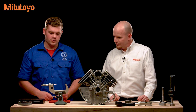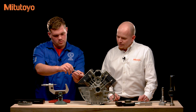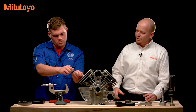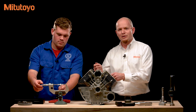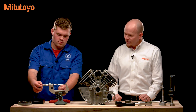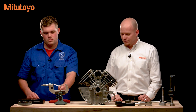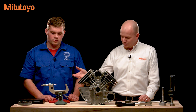We added eight ten-thousandths on this one — eight tenths higher. As you can see, there are a lot of potential sources of error with these. There's no live reading when putting it into the inside diameter, so you have to put it down, get a feeling for it, lock it down, and measure it. Because it doesn't have a live reading, you have to measure and verify. The gauge is also then measured by a micrometer, which is another source of error, and it's slightly difficult to line up the telescoping gauge between the contact surfaces of the micrometer — if not perfectly lined up, you'll get a false small reading.